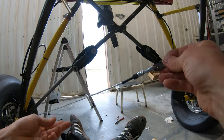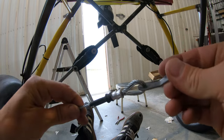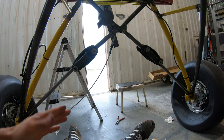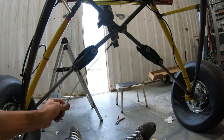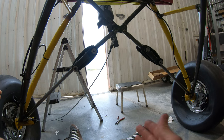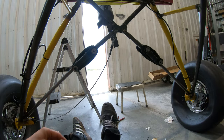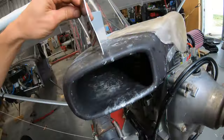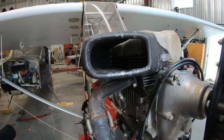Just had these beautiful cables made — I'd say they turned out quite well. I even made my own tabs. They're safety cables, so basically if this bungee decides to let loose, this will hopefully catch it and I won't completely squash my airplane. That's the idea behind these — I've got one for each side. Basically it's going to be something like that, so all the air doesn't just go and cool the back cylinder.